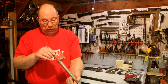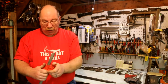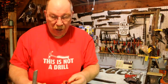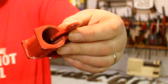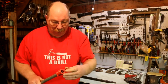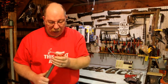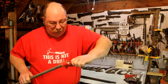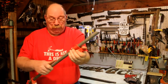This cam lock on the end is also less than perfect. It doesn't have enough grip surface, it doesn't grab well. It just relies on little teeth in the lever. And since this is an inexpensive clamp, they're not very good teeth. So if you're out buying new clamps and you see one of these and it's the only thing you can get, go ahead and buy it. But if you've got a choice, spend a couple dollars more and get a better one, because this is just a pain in the butt to work with.